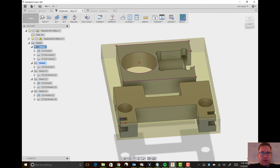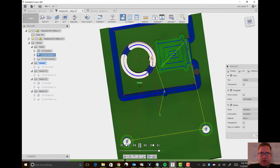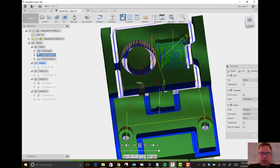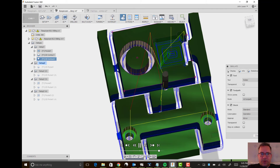I'll show you the simulation of that milling job. You're just going in — you saw that earlier in the video — using that 1/16th inch end mill. It's leaving tabs so that those little pieces don't come out. I found those tabs are really important. In my earlier days I did jobs without tabs and found that I would screw the piece up right at the end because it wasn't being held down. Those are pretty easy to break off at the end — you want to make them just small enough that they break off cleanly by hand.